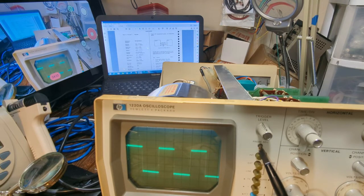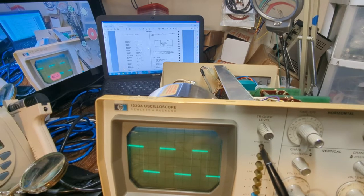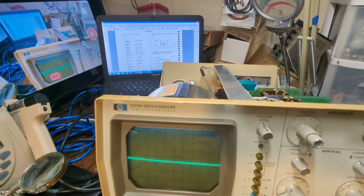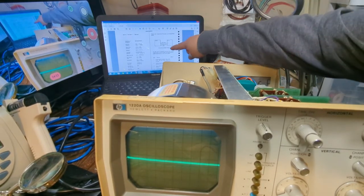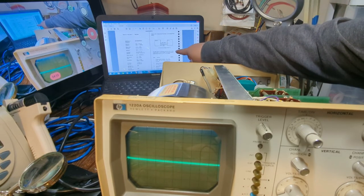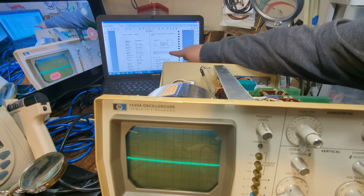So what this is telling me right here is, first of all, you need to check all your voltages. Let me go ahead and disconnect this probe now that we've done that part. You need to check all your voltages with the DMM, and they're all on the vertical amplifier board, all the test points. Basically what it says here is that the 95 volt supply is adjustable. It's an adjustable reference for the 12 volt supplies, okay? And the 210 volt supply. It is normally adjusted to produce highest accuracy on the 12 volt supply.